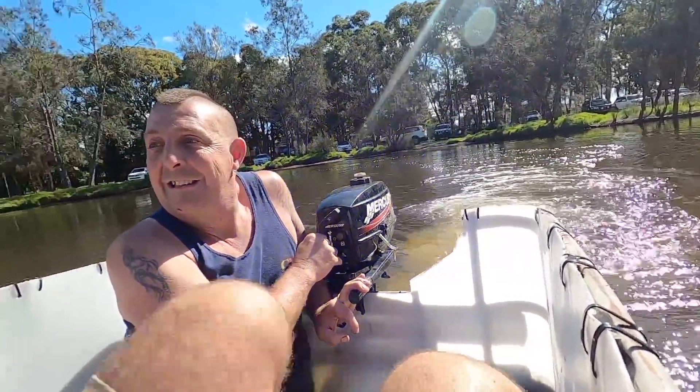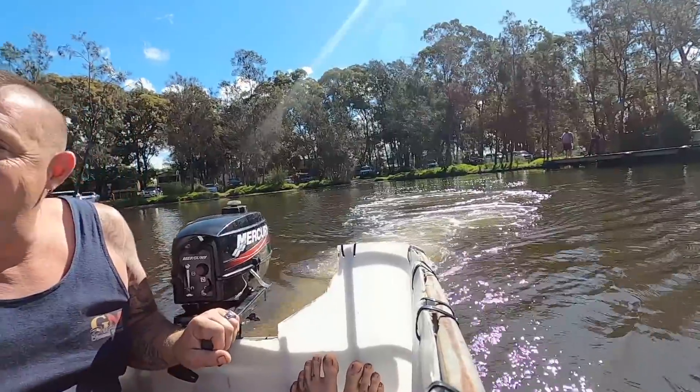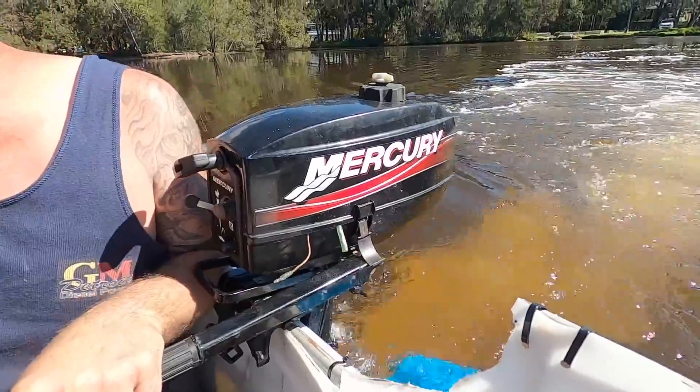I guess we should go to the pump-out. It's pretty good now we're down low. There's a clunk in the gearbox — possibly skipping a tooth, no clutch. We may have a slipping dog clutch. See, here you are — out in nature, you've spent your $200, you're fishing. Everything's legit. It's moving a lot of water for a little prop — the prop's still too big. I think we got the size right but one too many blades.